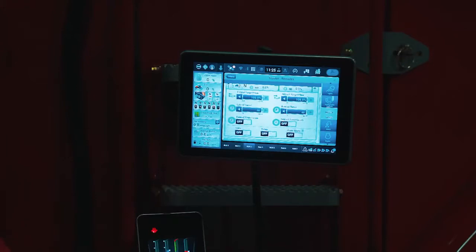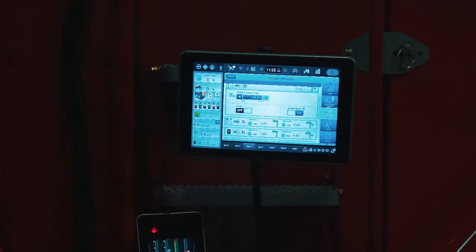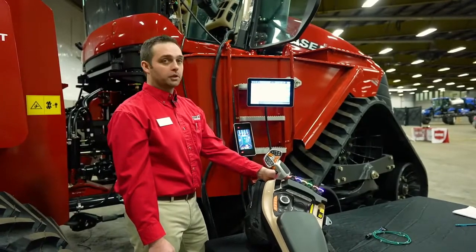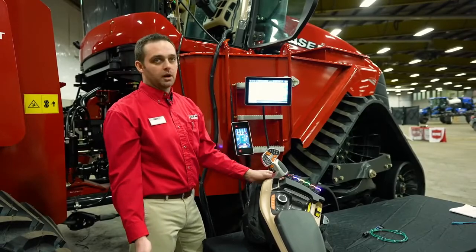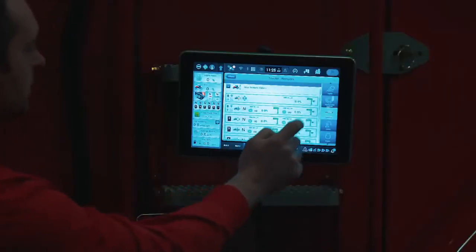to use, put it all the way into the float position, turn motor mode on, and now I have enabled motor mode. I simply return it to neutral, and now press the remote to the first detent, and now I have continuous flow in motor mode. To turn the hydraulic flow off, simply pull the remote back, and now you've turned the flow off. So this is where you make all your changes for all hydraulic remotes.